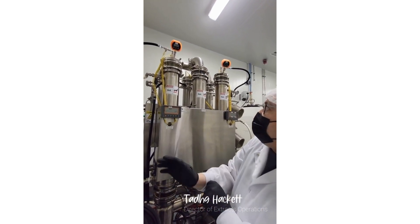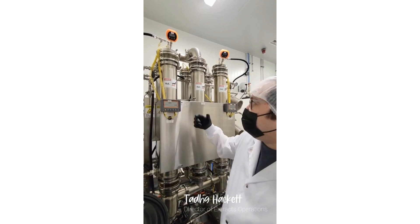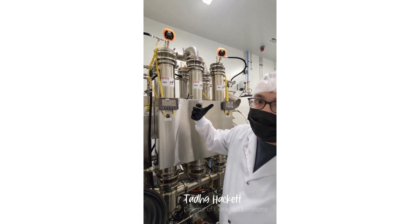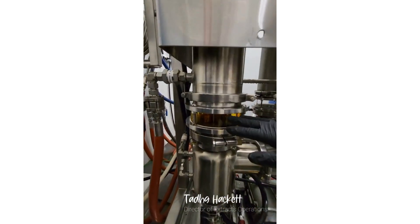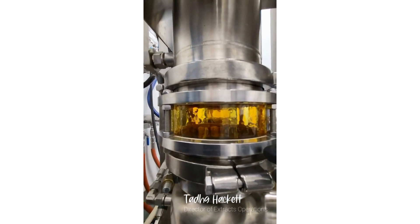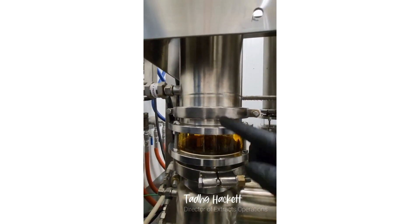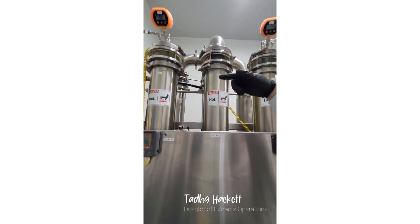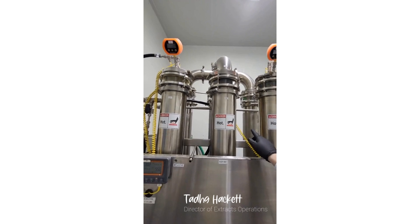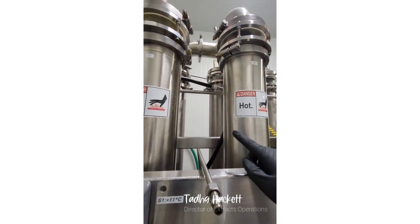At the vacuum and temperatures of the bath, that will evaporate the ethanol, leaving the cannabinoids on the outside of the column. So you can see down here, the cannabinoids flow down the outside of the column, and the ethanol vapor flows through here, up this middle path, and into the rear side. On the rear side, you can see with all the condensation on them, in the back there, there are three condensing columns.